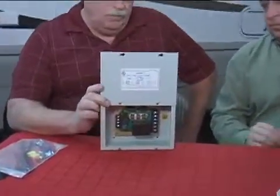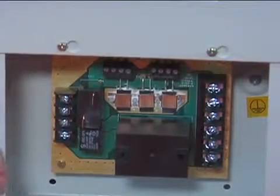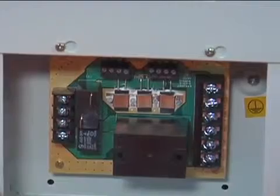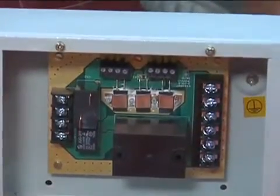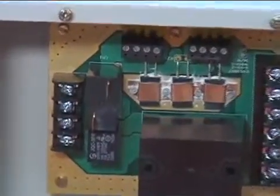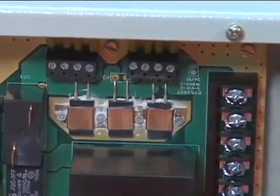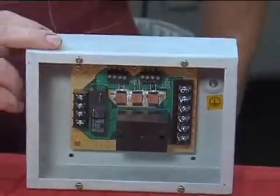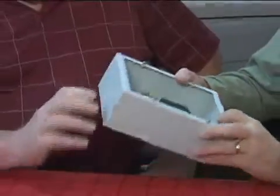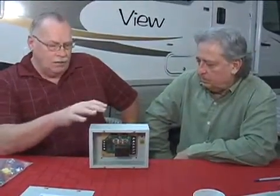Show us the other box you have there. This is the controller that runs the system. We went through a lot of trouble designing this controller — this thing is over-engineered about as much as you can get. The box is a NEMA 1 box, actually made out of 16-gauge steel with welded joints. It's a hefty box for its small size. The printed circuit board — everything in it — is over-designed by 35 to 40%. The most current the system draws at any point is just over 20 amps, and this is a 30-amp relay, so there's a lot of headroom in that.